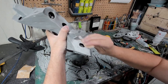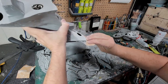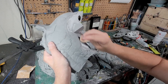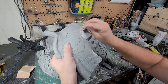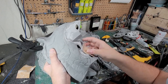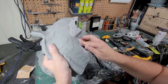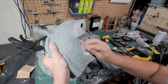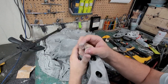Ideally I can use five minute epoxy because it just kicks off quicker, but on some of the other parts that'll take a little more time for clamping, I may have to go to a 15 or 30 minute epoxy — more work time but it takes longer to cure. Thirty minute epoxy doesn't fully cure for 24 hours; you can handle it after about 10 or 12 hours, but ideally let it sit for a full 24.